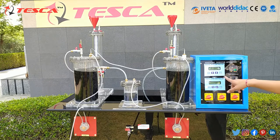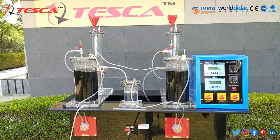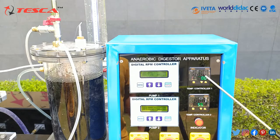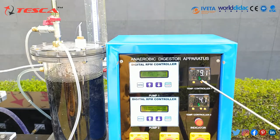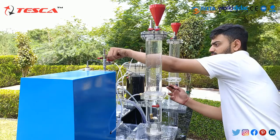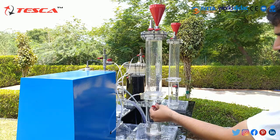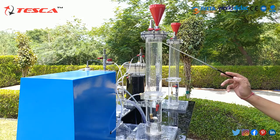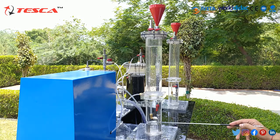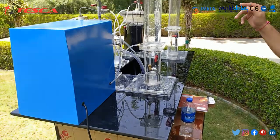Now as you can see both columns have reached the required level mark, so we will stop both pumps. The temperature was earlier at 33 and is now rising near 39, slowly increasing toward the set value. For the experiment, slowly open the valve on column tank 2 and then open gas collection tank 2 valve. You can see the water level is decreasing in the upper tank as air rises, and the water level at the lower end is increasing. The drainage is going down and extra water is relieving out of the tank. You can measure the gas volume here.